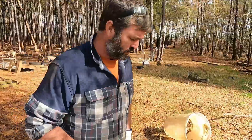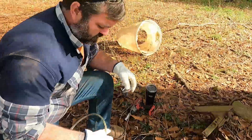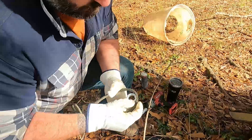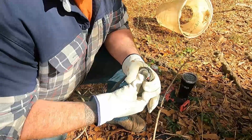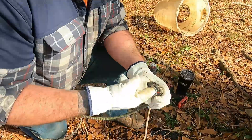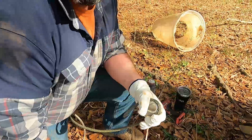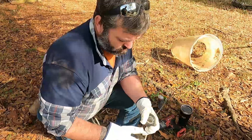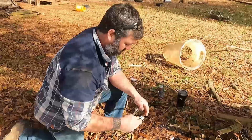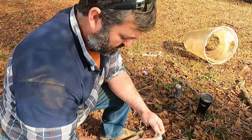Had to get a couple cool tools together. We've got our cable guides here — these just help when we put our clamps on. Any time you're jerking it, it's going to guide and guard these individual strands from getting chafed up and just help the cable last a little bit longer. All right, so we've got our cable clamps here and our cable guides.